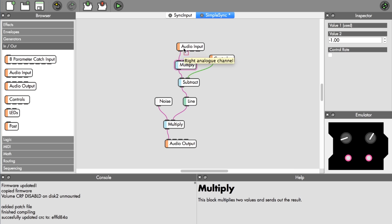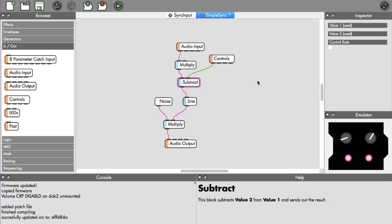Now, because this is an analog signal, it doesn't necessarily mean that it's exactly 0, so it could be a bit above. If we use that as a trigger, then it's not really a transition from 0 to a positive value if it's like 0.01 or something. So just to make sure that it is negative and then goes into a positive range, we need to subtract something from the signal, shifting the whole signal down. In this case, I just used the left knob here to change by how much I shift that signal up and down. And what we then get here is a signal that is very likely negative, and at some point, whenever it gets this trigger from the Volca, goes into a positive range.